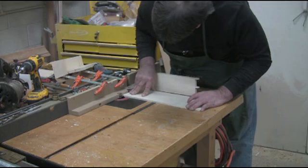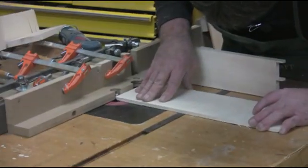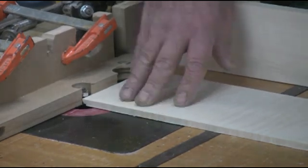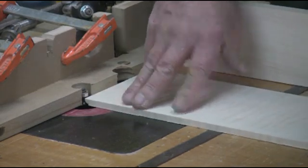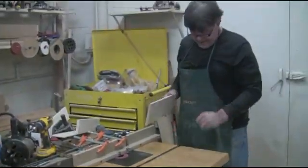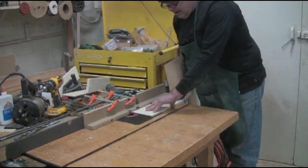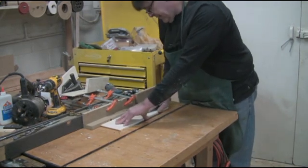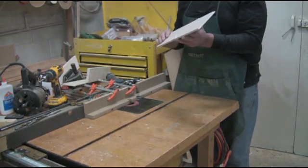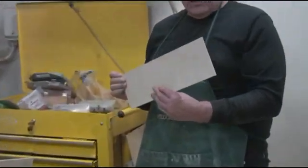Can you get that? That little edge is being caused by the little teeny washer that's under that. So I'm not even engaging the bearing at all. See it? Can you get under that, Crystal? All right. So without this fence, we'd be digging into everything. That little line will sand right out. All right, we're good on 3 sides.